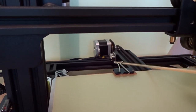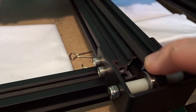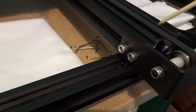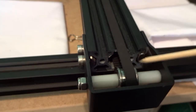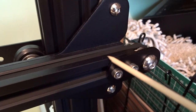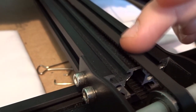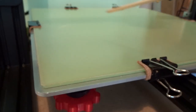At the back there's also a Y-axis end stop — another micro switch. So it's got three micro switches total. At the other end of the Y-axis there's a roller — this is where you tension the belt. You loosen these off, pull it out, tension it, and tighten it up. You can mod that if you want a screw-bearing tensioner. On the X-axis, you similarly slacken off, loosen it out, and tighten up. You need quite a lot of tension — not drum-string tight, but pretty tight — because when the motor moves a tiny amount you want the bed to move exactly the same with no slack.